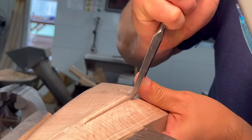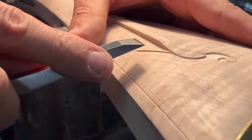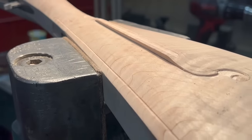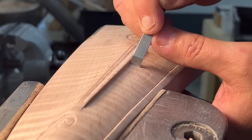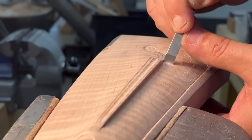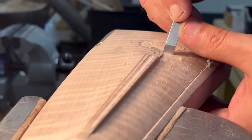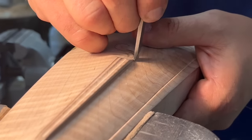You don't really want your relief to dive in around your carving — some originals you'll see that but it's a lower grade of carving. You want to fade it out a little bit, carry your lines through your stock so it looks like your carving has been applied to your surface. You don't have to take that to extreme, but avoid diving too much. For big open areas, you can use a mill file — a single-cut eight-inch file — to get in here and straighten these areas up.